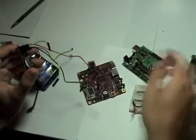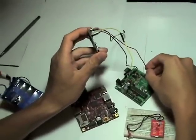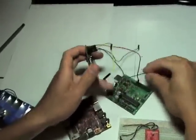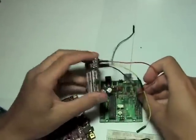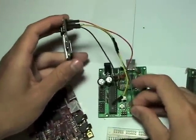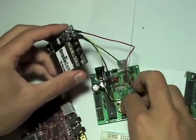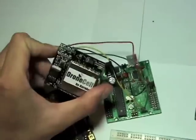Really any device that has UART and power. So for example, on the RoboDuino, I would just connect power, then connect the RX and TX — and voila! The DroneCell would be up and running and fully operational.